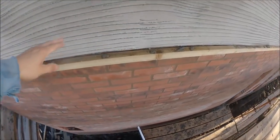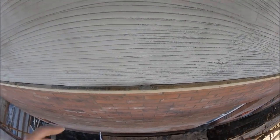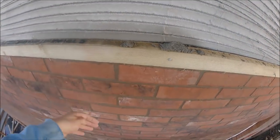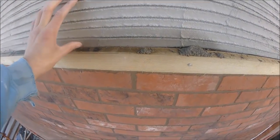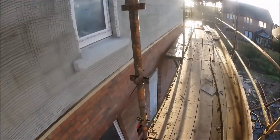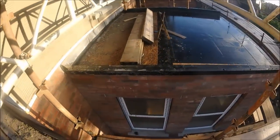The front will look like a continuation of the windowsills. You can see there's DPC in there. Someone was asking — I think it was my mate Kai from America — would this not create damp issues? It shouldn't be too bad. The brick underneath should be sealed, and the PVC goes in and curls up around behind the block, so any water that gets in should be forced back out at the bottom of the band.